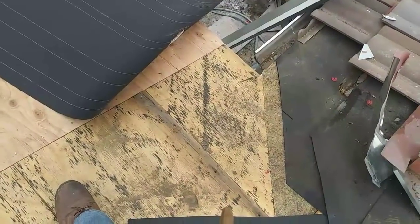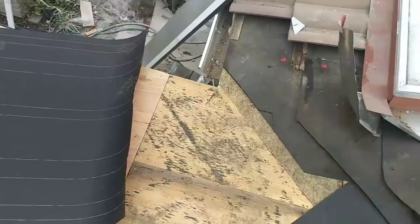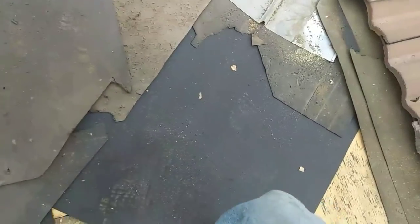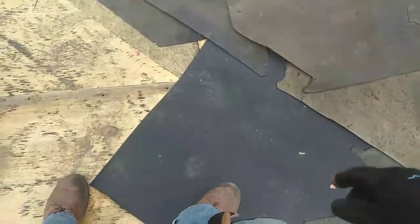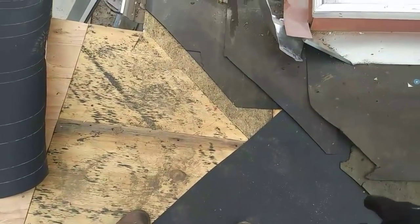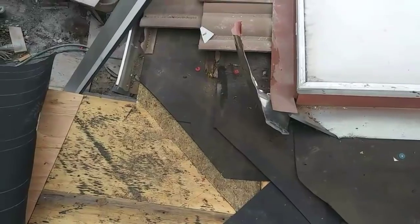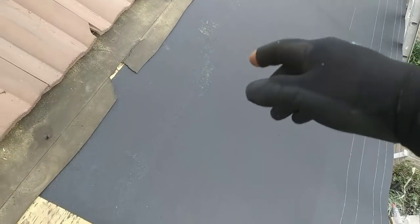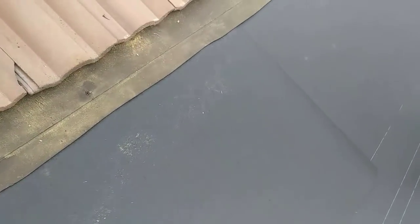That's gonna help me overlap all the way to the bottom. Just put it in pieces — don't put a big piece because it's gonna cost you more and give you a hard time dealing with big pieces. Put them in little pieces. Just make sure that one tucks underneath the other. I'm putting in the layer — it still needs another half underneath the felt — but I'm putting in pieces because I have to tuck it underneath the 40-pound felt. They use one layer of 40 pounds.